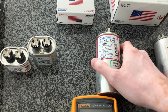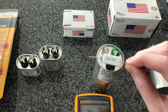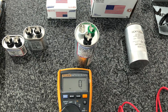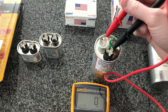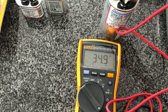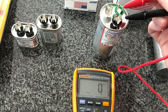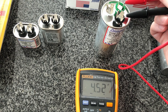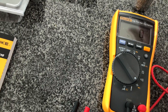It's important to note that before taking these capacitors out, I shorted them with a bleed resistor and then directly with a screwdriver. In both cases they had essentially no voltage on them from the multimeter, but just for safety. Let's test this dual run capacitor — the compressor side reads 34.9 microfarads, which is perfect for a 35µF capacitor. The fan side reads 5 microfarads, also good — though we won't be using that side.